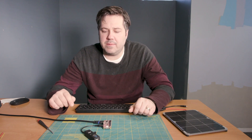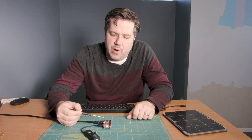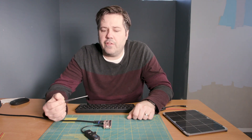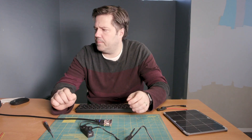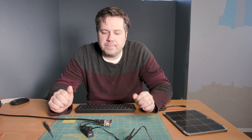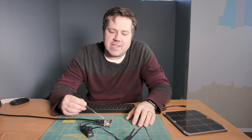I now have the Raspberry Pi and the Pi Juice connected back up to the keyboard and the mouse, with the HDMI cable connected for a monitor. I'm going to go ahead and power this up. I have two options: I can power it up through the Raspberry Pi board or through the connector for the Pi Juice. For the first boot so that I can load the software, I'm just going to plug into the normal Pi connector. Once I do that, the system starts to boot up right away. The Pi Juice itself has a separate connector that can take different voltages and amperages and condition that into either charging the battery or powering the Pi, so it's much more flexible. But for right now, I just want to get everything booted up and install the software using apt-get.